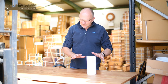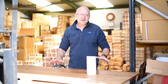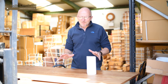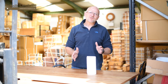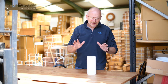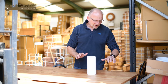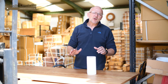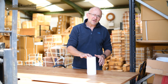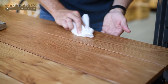The first coat has been applied with a brush — we've put plenty on there, brushed it in nice and hard, got it in there — and you'll notice almost immediately it's been sucked in by the wood. With oak, it's primarily made up of two grains: a hard grain and a soft grain, like the winter and summer seasons. The important bit is we've done the first part now, soaked it in there as a base coat to build everything up from. I can see around some of the hard grains it's still a bit wet, so I'm going to get a bit of kitchen towel, go over it, dry it all off, turn it over and do the other side. Remember to dispose of it properly.